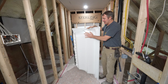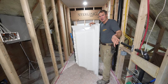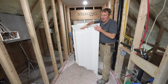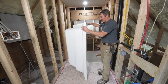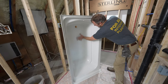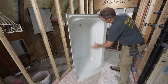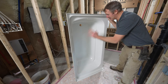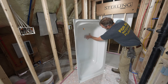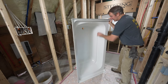This is an acrylic tub, 32 by 60 inches — a pretty standard size. They make them in other sizes too; you can get a 30 inch if you have a smaller bathroom. This bathroom is a 5 by 8, and 32 does give you a lot more space. It has a little friction-type surface on the bottom that's easy to clean — not like those glue strips on cast iron tubs that always got dirty. It's just a rough surface of the acrylic so you won't slip.